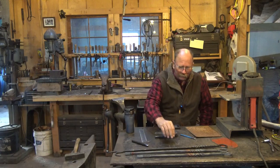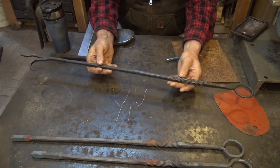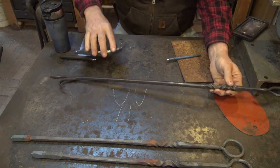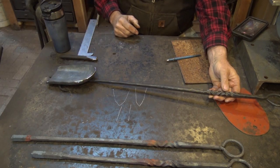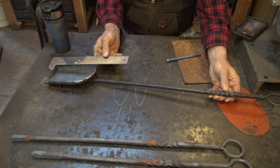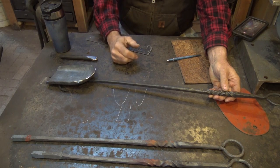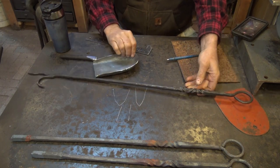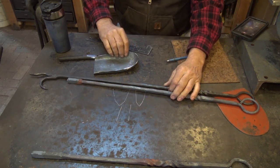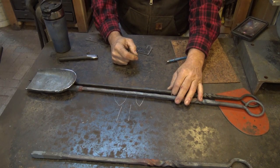When we did our poker the other day, we made our handle and poker all out of a single piece of about 24 inches of material. Now, for a shovel to be the same length as the poker, we're obviously going to do a little bit shorter handle, and I try to make these match. I always try to start by making the poker so I have this piece defined. Then when it comes time to do the shovel, I can trim the shovel handle to the right length.